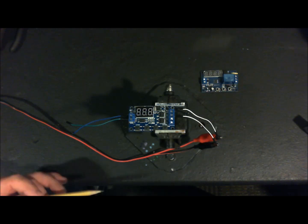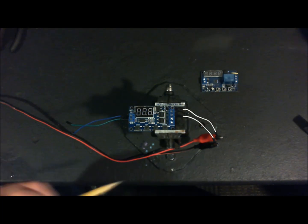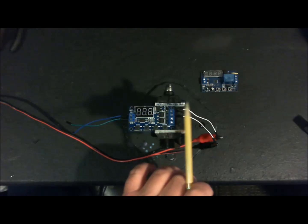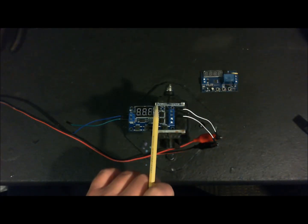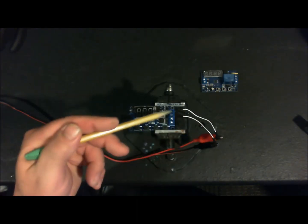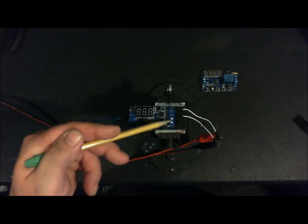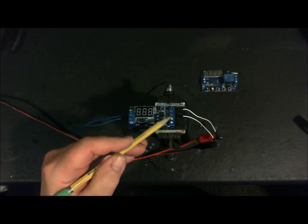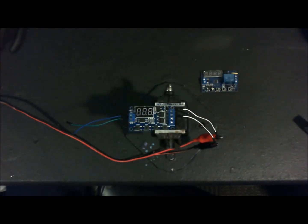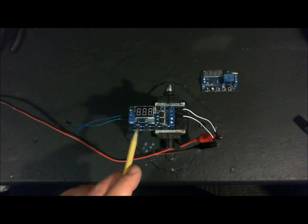These range from 5 volts to 36 volts on this side of the board. What you put into this side of the board — on a normally open contactor, when this is normally open, your input voltage ranging from 5 to 36 volts will come out of here when that circuit closes. So if you've got 5 volts coming in, you get 5 volts coming out when the circuit closes.